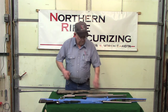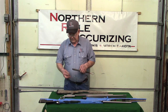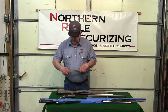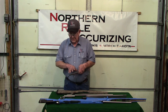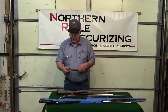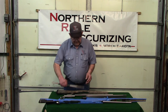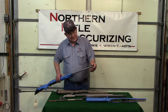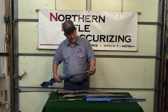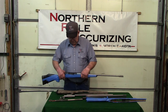We can basically take your factory rifle — say if you can't handle the recoil — we just take your rifle, thread the end of it, and put the brake on. It just screws on and then we time it so that it's centered up with the center of your receiver, so your ports are on the top of the barrel. Then we machine it down to match the contour of your barrel so it kind of looks like it's all part of the barrel. Some of your lightweight sporters in the bigger calibers we can't quite get them that small, so you might end up with a slight rise on the end. This one here I think is a 300 Weatherby Mag, but with something like this on it a 300 Weatherby is really nice to shoot.